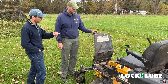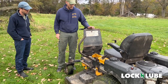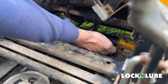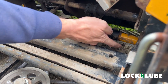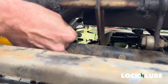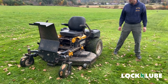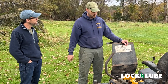Let's talk through what's going on with the mower and what we're hoping to do with this relocation kit. This is a mower I've had for probably 10 or 15 years — it's more of a commercial grade, so there are a lot of grease fittings on it. The really troublesome ones: there's one right here where the vertical clearance to other components makes it really hard to actually get a greasing tool onto. The other two — the control hubs front and rear — are way back in here, with another matching one on the other side that you can tell has not been greased in quite a long time. My goal is to bring those out to somewhere easy to get to, so in my normal greasing routine it's something I can hit really easily.